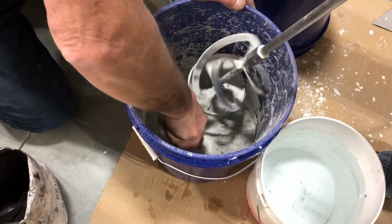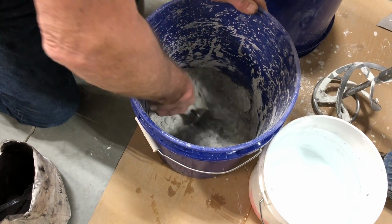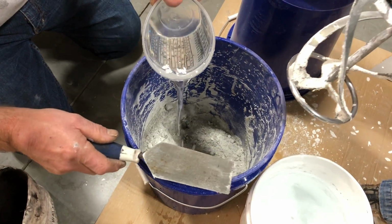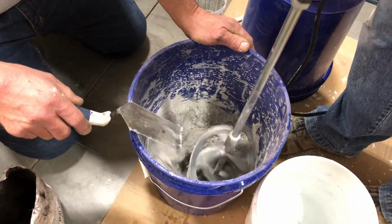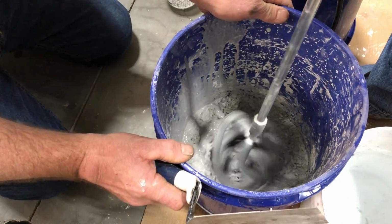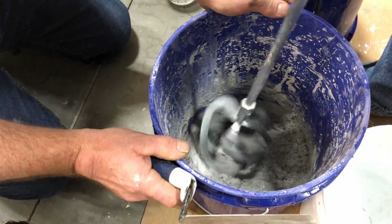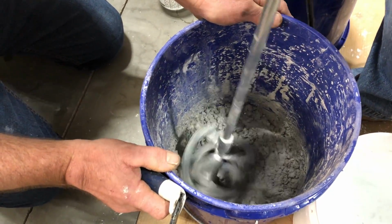You can see 10 ounces was not quite enough, but it is closer than you might think. We are going to add some more water, 1 splash at a time, until desired consistency is achieved. With that last splash, the mix got too wet. We are looking for a crumbly mixture with little to no flow.